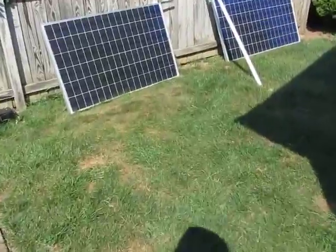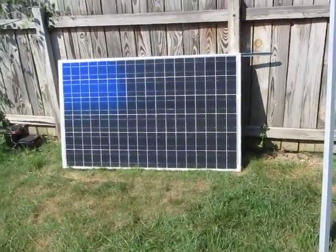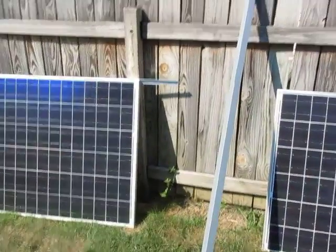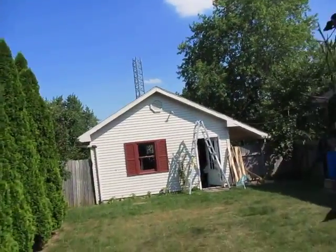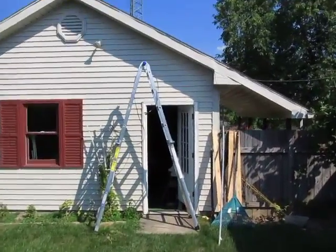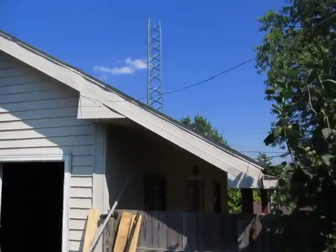I've got a couple of 200-watt solar panels for a 24-volt system. You'll see I'm cutting up some angle iron here. What I'm going to do is space these apart about four inches from each other and set them up on a rooftop up here, so they're going to sit up on this roof.